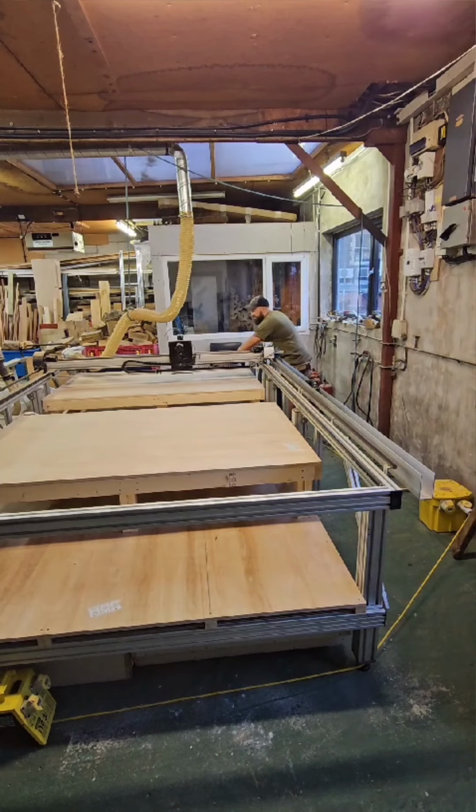But now you can see my depth from the underside is what it was in the previous videos. This is now 100mm instead of 80mm. And then I can move these up and down, fix them to the base, however which way I want to do it as a carpenter. And then I've got a movable, changeable depth on my CNC. So I've now turned this into the best machine I've ever had in 23 years by the slower you go, the faster you go, by thinking about it.